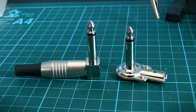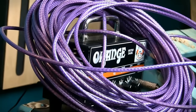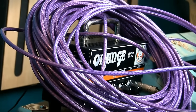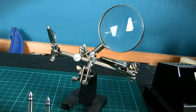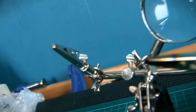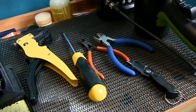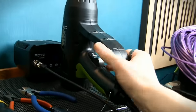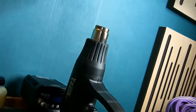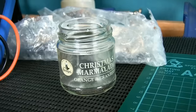Let's go through everything we need for this: obviously the jack plugs and the cable — this is Shark brand coaxial, good quality but nothing stupidly expensive. Soldering iron, and our helping hands, which will hold the cables and jacks in place while we solder them. An assortment of clippers, strippers, blades and screwdrivers, and of course the mighty heat gun so we can shrink down our heat shrink tubing. And lastly a wee container for small parts.